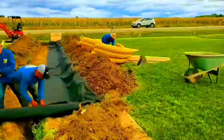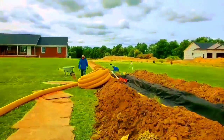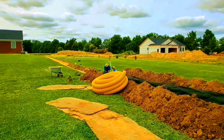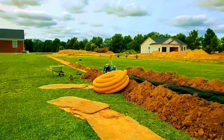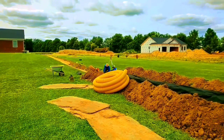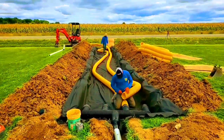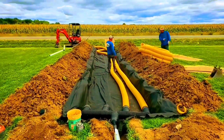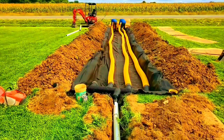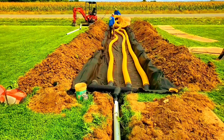After the eight-ounce double-punched filter fabric goes down, we grab the six-inch pipe — look at those big coils, they're as tall as the men. These are the chambers that hold the water, and it slowly enters the subsurface just like rain. Six-inch yellow virgin material — not made out of recycled material — is stronger and will last 200 to 500 years. Recycled materials don't have the longevity or the strength, which is why we use the blue and yellow pipe — both all-virgin. You can see we used our FDM super-sticky, super-stretchy tape to make the connection from the sump line to the manifold. Look at how big those six-inch chambers are — monster six-inch chambers that are going to hold a lot of water.